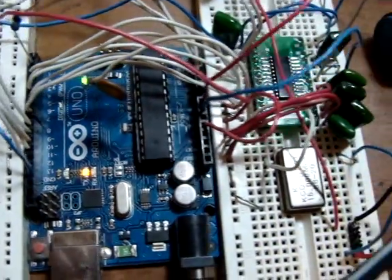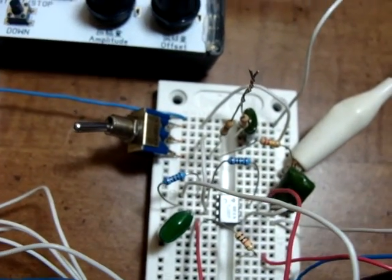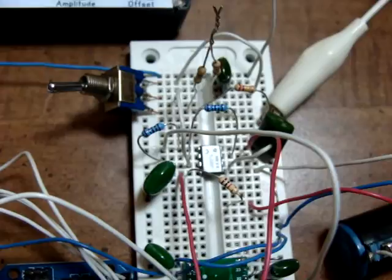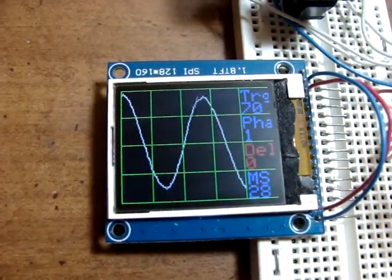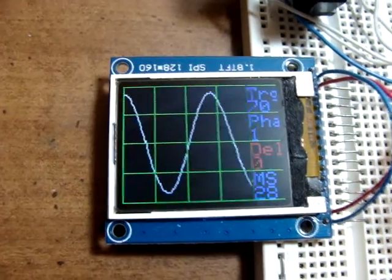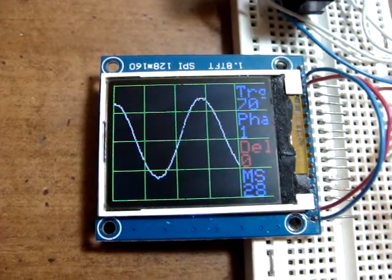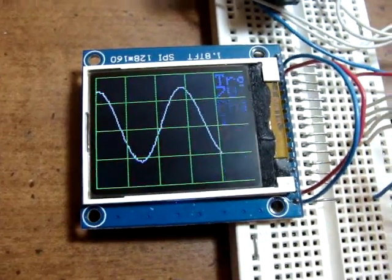There we have it — my latest Arduino oscilloscope using the TLC-5510. And that TL-032 op-amp on the front end really improves the noise figure. It's nice and smooth and sharp, even on a square wave. You can see I got my trigger circuitry working really good.